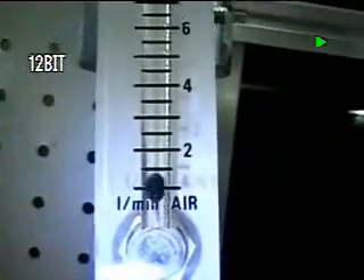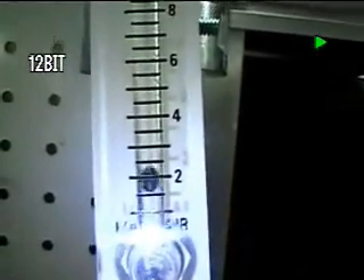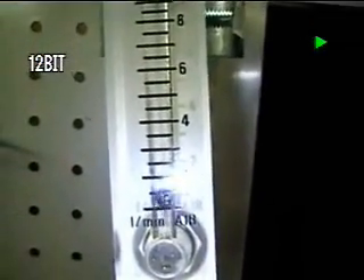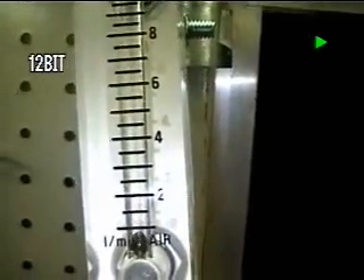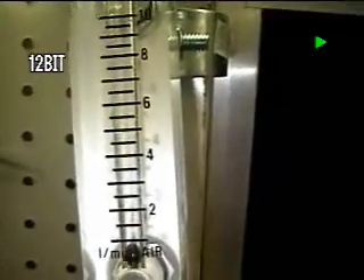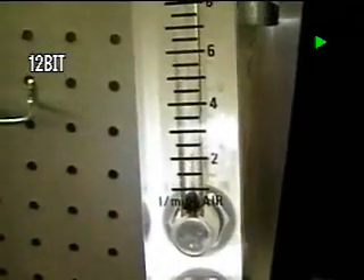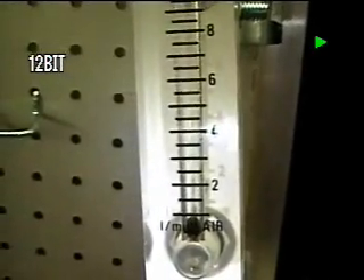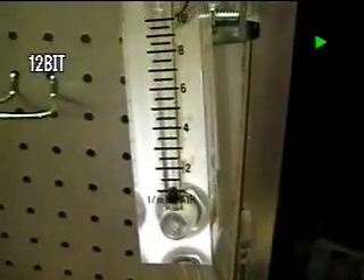That's what we're running right now. And if we follow this hose all the way over here, running at that setting, you can see right now we're going from zero, bouncing up almost to three liters per minute — pulsing is what we're looking at. And that's really not too bad, figuring we're only running 4.7 volts and 10 amps total across four cells — that's one and a quarter volts per cell and roughly two and a half amps per cell. We could turn that up and go higher if we wanted to.